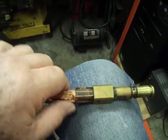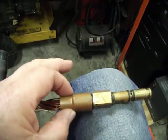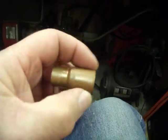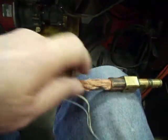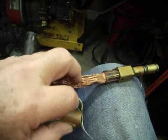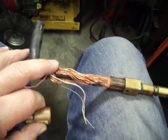I'll cut this crimp off. I found a copper plumbing supply piece here which is the exact diameter, and leaving this on will actually make a better contact. So the large part I'm going to crimp onto this, shortening the wire back here. I'll move all this back to this point, and then this crimp will be back here. The inner part, where the gas feeds through and the liner goes through, I'll cut back as well. So all of this will be about four inches shorter than it is now.